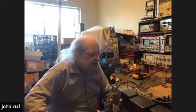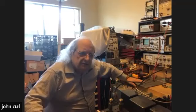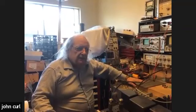They didn't say it was a Quad. They told me, that's why I know. But they just said this amplifier has complex feedback systems. It does. That's why it even measures good at all, nominally. On this test equipment, it'll measure fine. On noise insertion tests, it tests terrible. Most equipment like this wouldn't make any difference. Noise insertion would conform to all the other distortions. No problem. We're good.